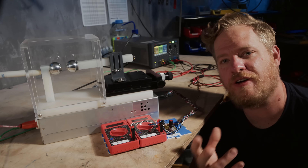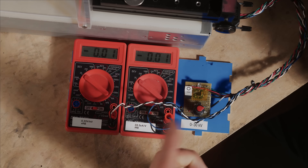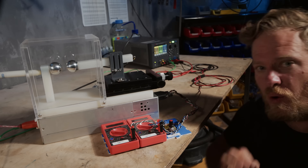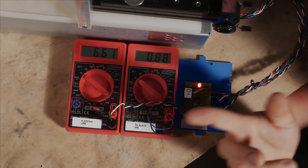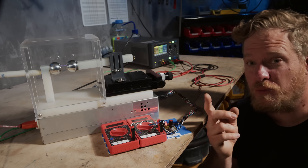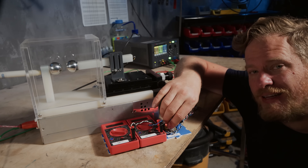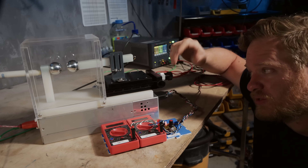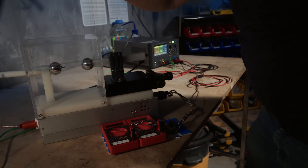Let's go back over to the workbench. This setup allows me to tweak various conditions. There's a knob here that allows me to adjust voltage, and these readouts show voltage and current between the two balls. This knob allows me to adjust the distance between the balls and measure it in a really fine-grained way. I've cranked things up to 25 kilovolts so we can see a bigger arc. There are a few things that affect whether electricity will jump across an air gap. First is voltage — if I turn the voltage down, the arc will stop. Second, the distance matters — if I make the gap bigger, the arc will stop, and if I bring it back together, it'll start up again.